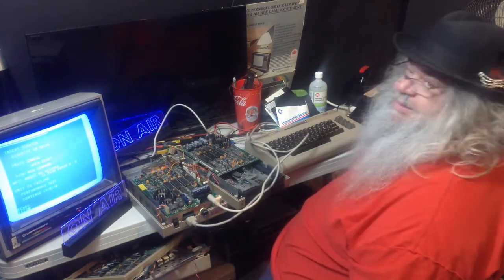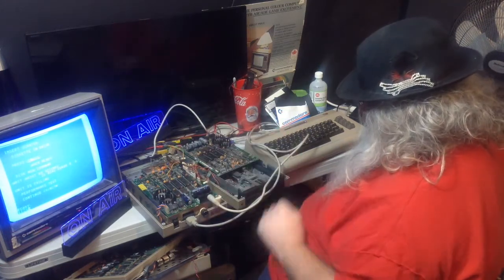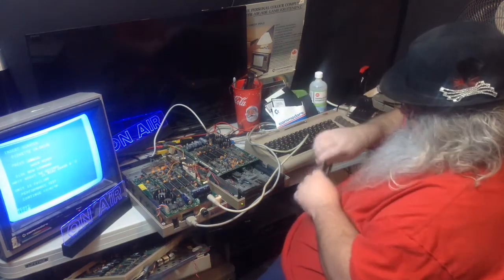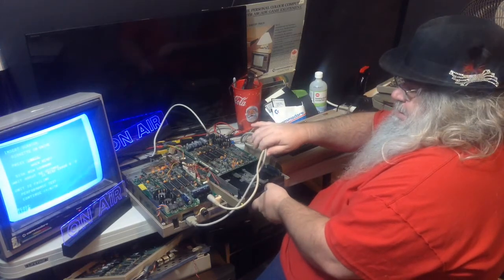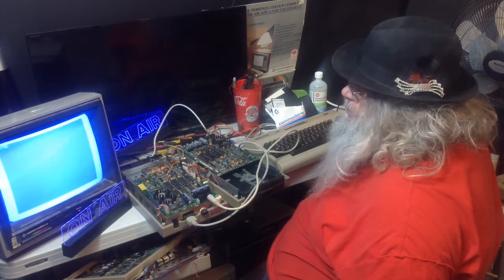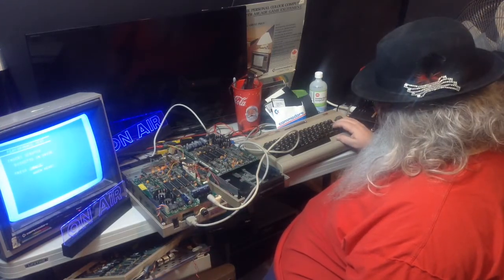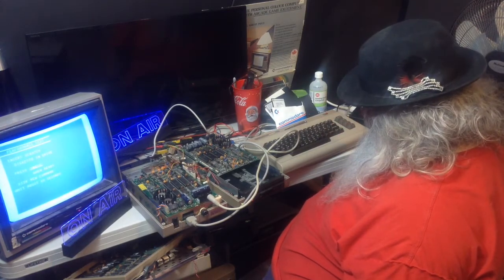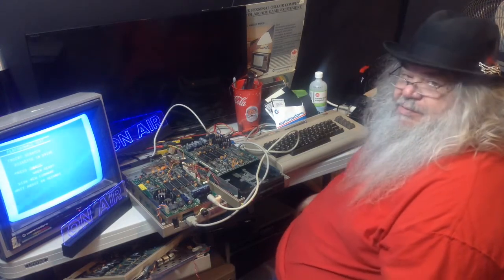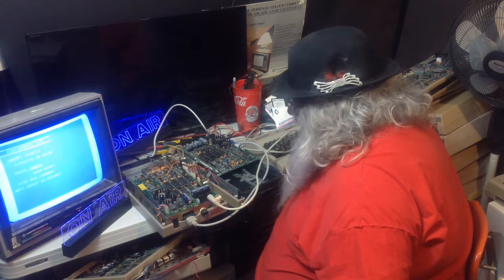So, if this goes as planned, I now have this circuit board with the chips that came out of this drive connected to this mechanism, and it should come on. And it did. All right. And as we have the performance test already there, let's try and run it. So the ultimate thing, what we're really doing here is we've eliminated the drive mechanism. We've got this other one that we know works. Let's see what happens. So far, it is sounding promising. It is.